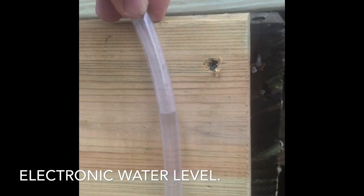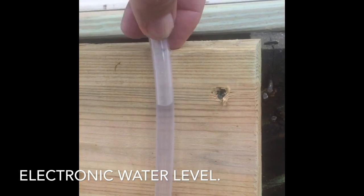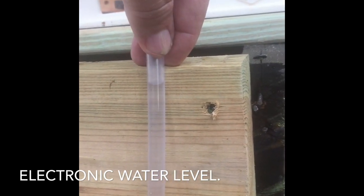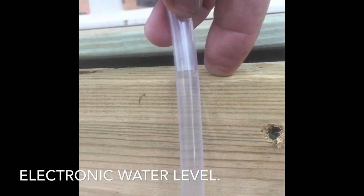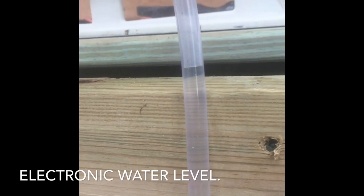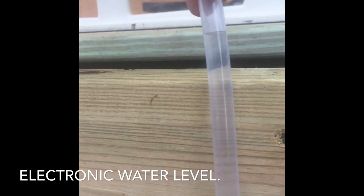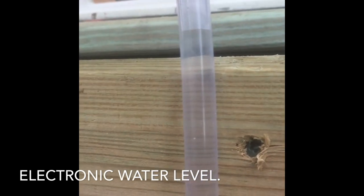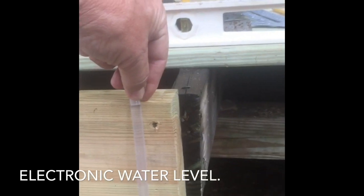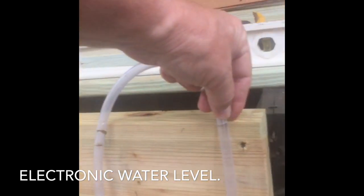You can see what the level is in the tube right now — this is the working end. I'm going to raise it slowly to the top of this joist, which has a face plate in front of it. You should start to hear the beeps when it gets close. There we are — level. So somehow, by hook or crook, this just happens to be level with the other end by some miracle. I'll take it.